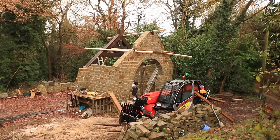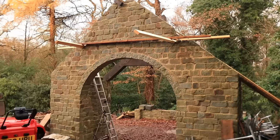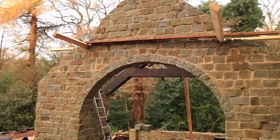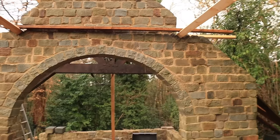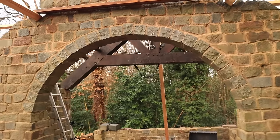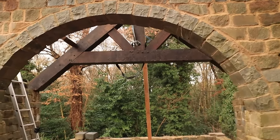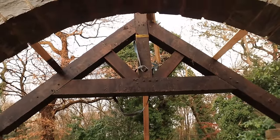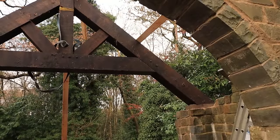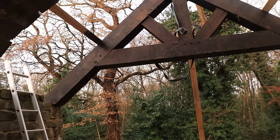It's the morning after the night before. There it is — it's still standing, it survived the night. So as we walk in through here, you get this first view. Basically, this is why I did the raised collar truss — it would have been so much easier just to put a beam straight across from where the foot hits the wall, but you would have had a big beam across the front of the arch. This way I haven't. That is quite something actually, honestly. I'm going to blow my own trumpet here, as we say in England, because I think that is actually honestly quite a significant achievement.